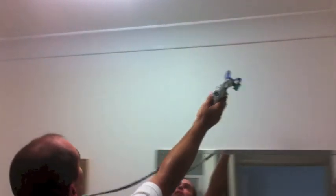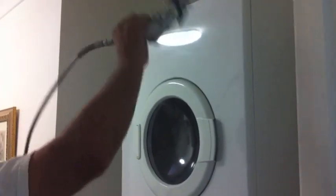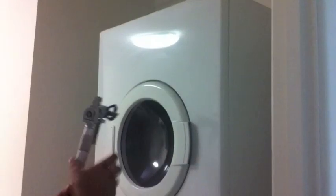Now here I'm doing a bathroom ceiling. Usually I'm just using a standard ceiling paint. This is only a small little job that I'm doing to freshen up someone's unit. Usually you wouldn't use ceiling flat in the bathroom ceiling. You'd either use semi-gloss or low sheen. Unless there's ventilation. If there's adequate ventilation in the bathroom, then you're fine to use ceiling flat. A lot of painters probably screw up their faces at that, but it does work. As long as there's ventilation in there, you won't get too many mold problems or anything like that.